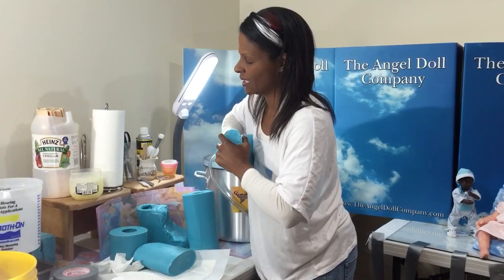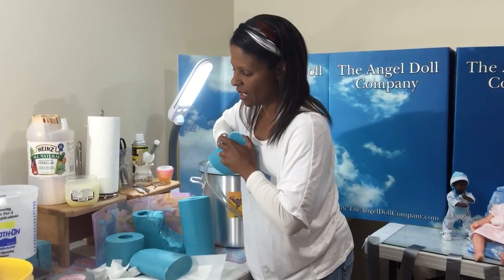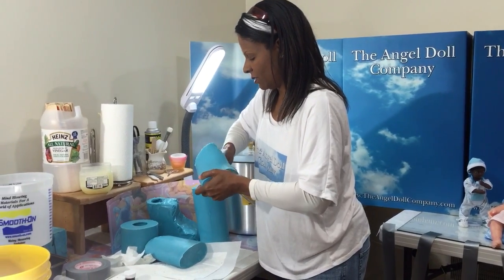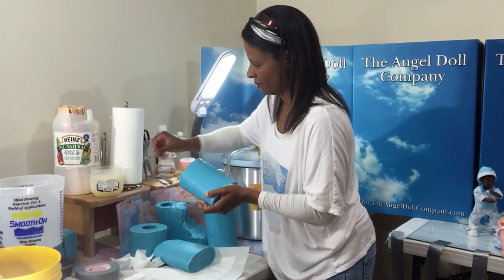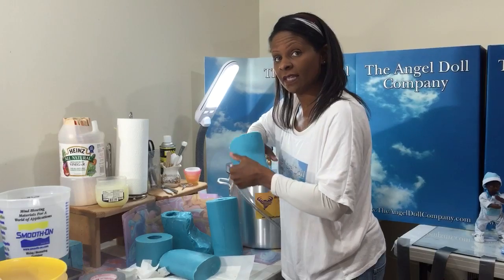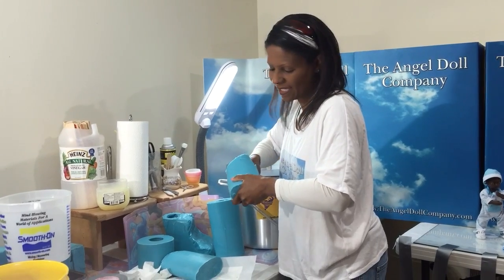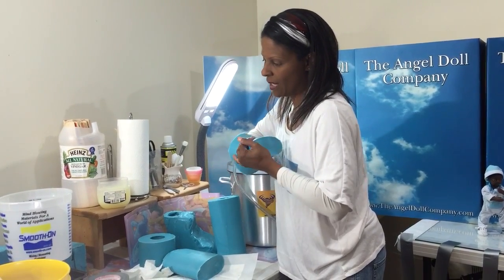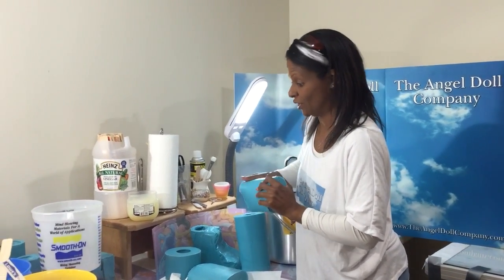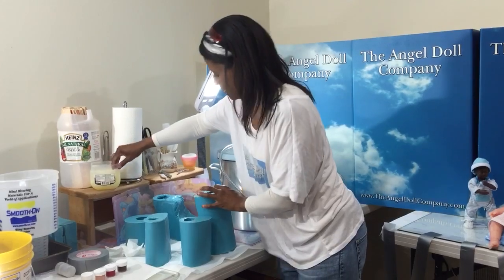Because you don't want to waste your molds. That's awful. You don't want to mess up your molds because you didn't take the time to do this properly, when it's so easy to do. It just takes patience. I have sprayed the Ease Release 200 with the Vaseline. It's fine. You can do it, but you don't need to. But if it gives you that extra security, like, okay, I'm making sure this doesn't stick, then do it. It's all right. I want to just double check.